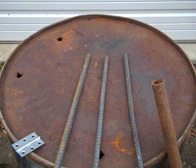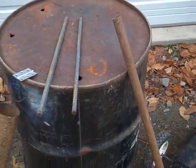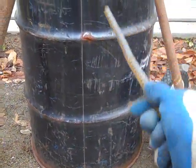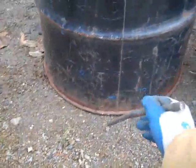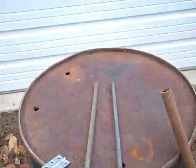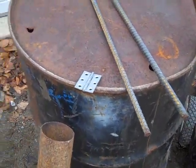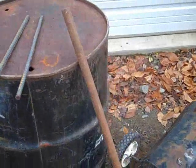The pot is going to be hanging in here, probably down to about this level, and it's gonna be heavy when it's full of lead. I wouldn't trust the lid of the barrel to be strong enough to support it, so I'm gonna put these rebar pieces along the bottom rim pointing inwards and weld them to the bottom of the pot for support, leaning inwards. This hinge is for the door I'm gonna cut for putting wood in and out, and somewhere I'll cut a hole for a chimney.